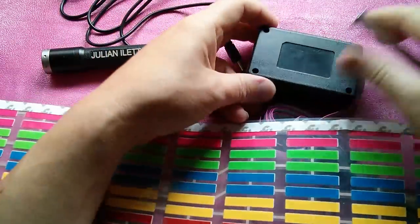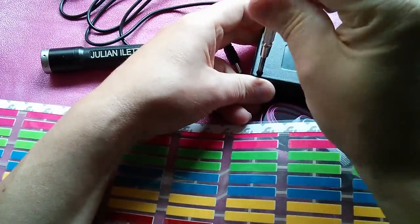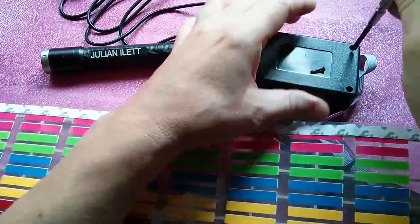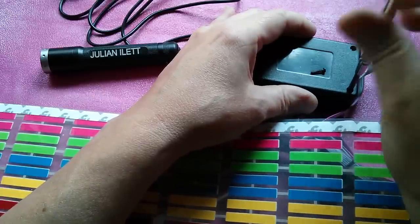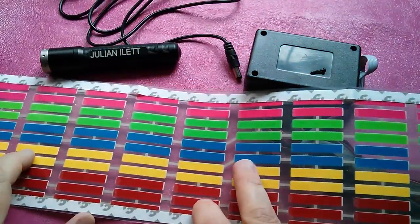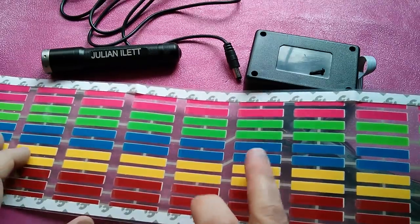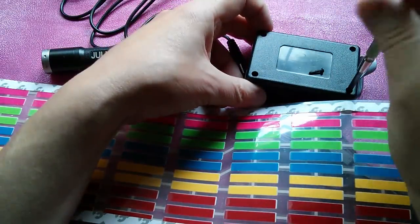Right, I've closed the blinds. That sounds really weird — why is it making that noise? I think we're going to have to have a look inside this box. Now, I'm assuming for electroluminescence, there's going to have to be some sort of high voltage involved, higher than 12 volts certainly. So is there going to be a step-up regulator in here, or at the very least an inductor of some sort, which might hint at stepping the voltage up to provide power for what are effectively light-emitting capacitors? Because if these are electroluminescent panels, they are actually light-emitting capacitors.